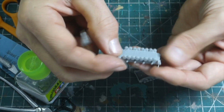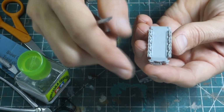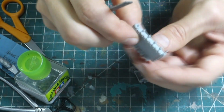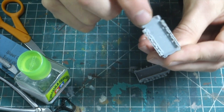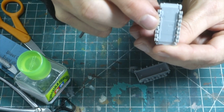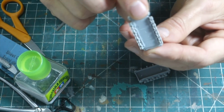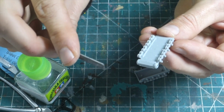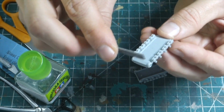Make sure all of your wheels are parallel and coplanar. That's the other thing. Both sides, if you've glued on the side pieces wrong and they're wobbly, again, you're going to have weirdness as you go. So keep each step of the build as perfect as you can get it.